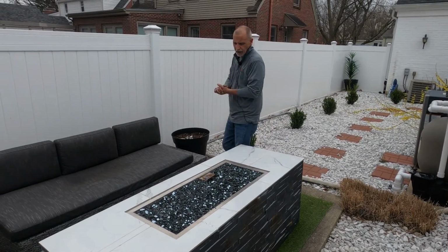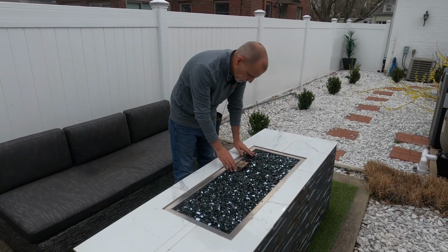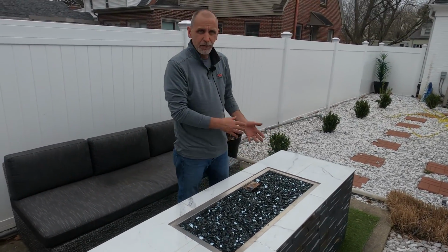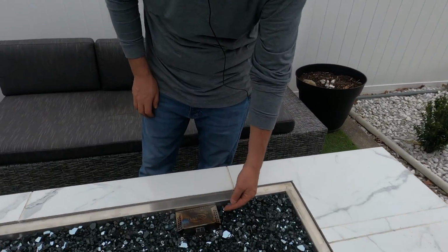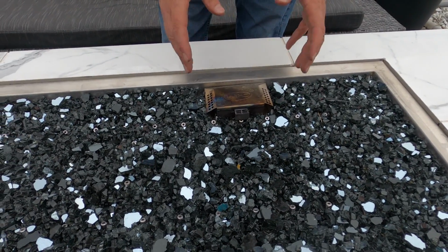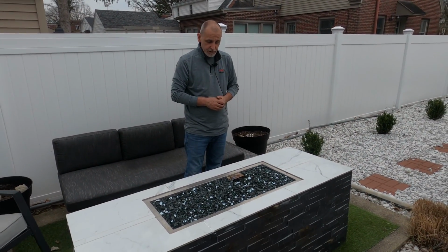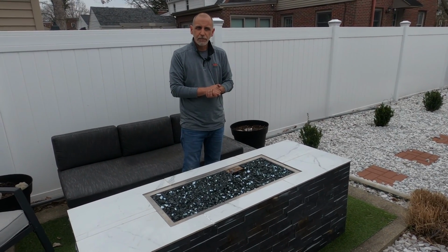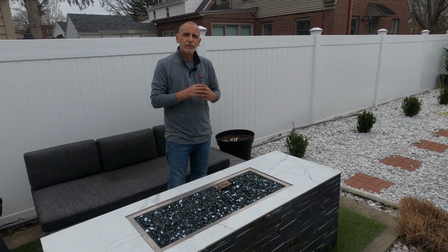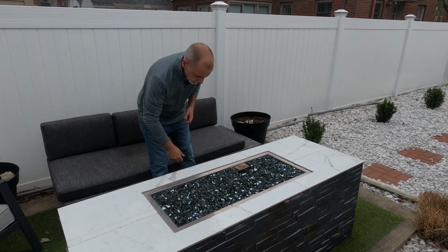One thing I forgot to mention earlier is the application of the media around this blowout box. It is rather important that we don't bury the top of that box. You can easily bring it up to the top of the lid there, but we do have to leave the perforations around the top actually exposed so we can get some proper air in there for the pilot. But again, we're gonna fire this thing up. Again, what we've done is replace the burner from our standard H burner to our new torpedo style H burner. And you'll see the difference in the flame height here.